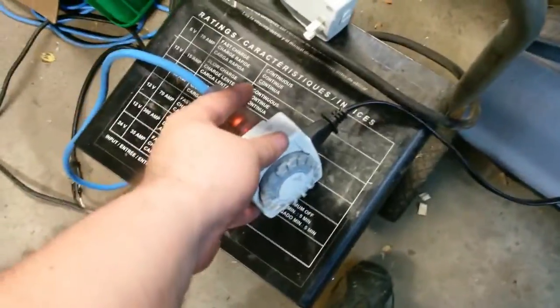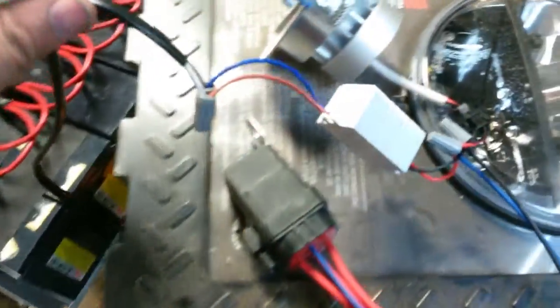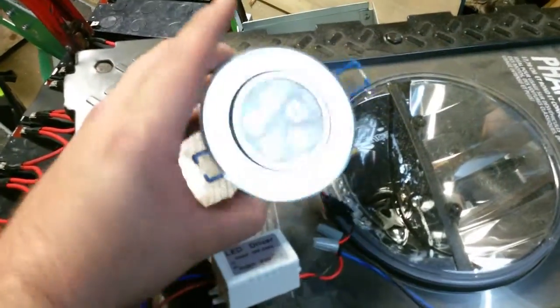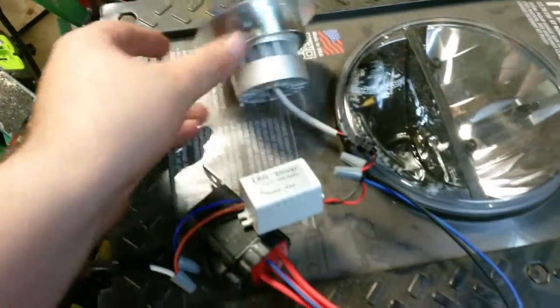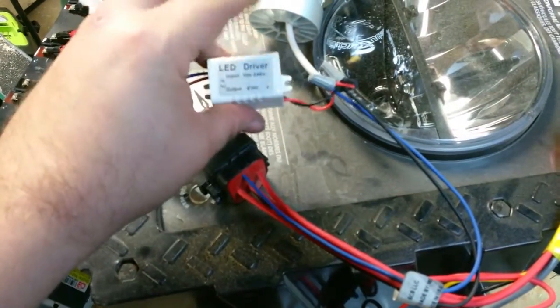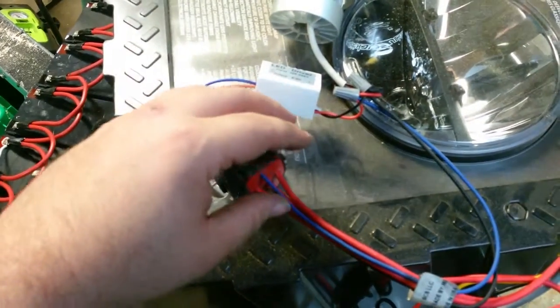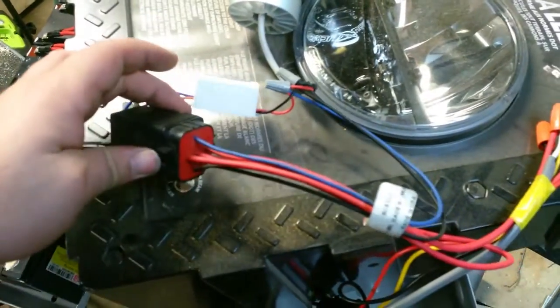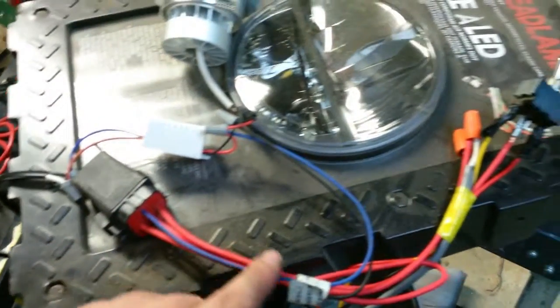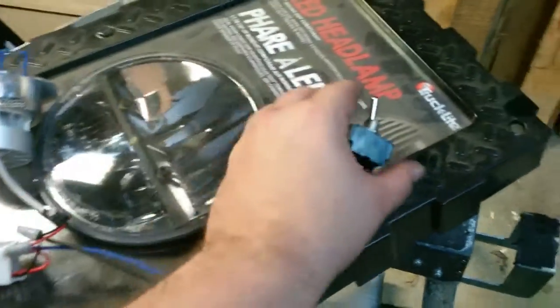I have this hooked up into the extension cord — that's plugged in and that cable goes over to the 12 volt transformer, which transforms down to 12 volts. I actually just have the LED on here to act as a ballast for the transformer. The relay then gets plugged into that and triggers the light.